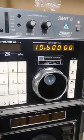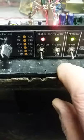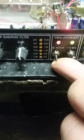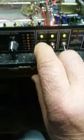Okay, I've taken my receiver up to 10 MHz — specifically 10.6 MHz — dialed in at 600 kHz AM, and invoking this to take it out. The audio goes away because it's not receiving anything. There we are — we're back. Notice I put the broadcast notch in. You can see it here — 600 kHz is near the bottom of the filter so it may not be at its sharpest, but it really works well.